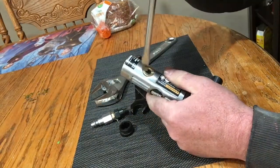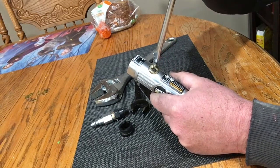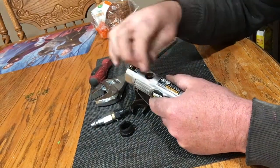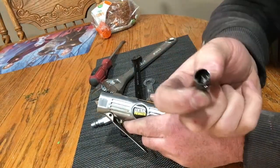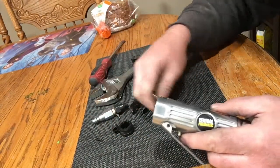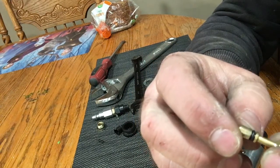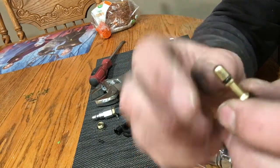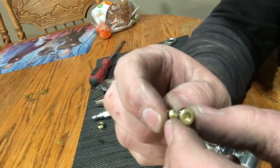Now this here is kind of like the same connection as on the Shopsmith switch. It's one of these things and it's a combination nut — it holds this thing here in this plunger cover and there's a little spring inside there. We'll just pop it out and you can see the spring right here. Push the plunger out. The plunger has some rubber O-rings on it. The small one I kind of wonder if it would actually seal anything. The big one here looks like it does seal something.